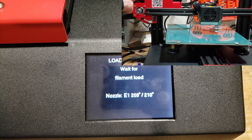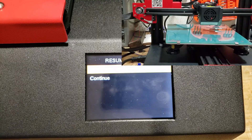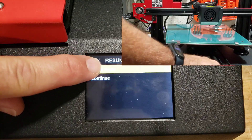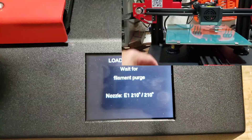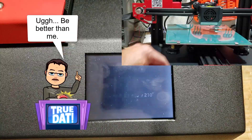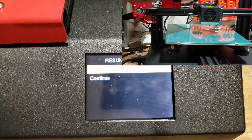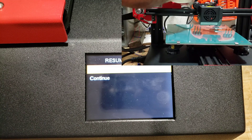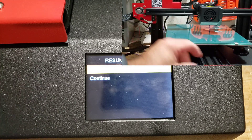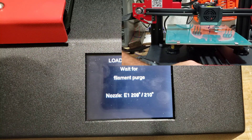I always like to hold back here because you can feel the filament being pulled. You can see a little bit of the white coming through — it is not all the way through, so I'm going to hit purge more and then watch for filament to come out the bottom. I'll do several purges because I was slow to get it inserted. I'm going to squeeze and push, and now I'll purge some more to get the white through.